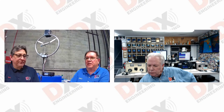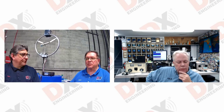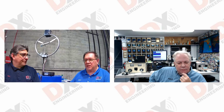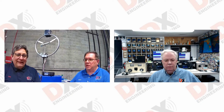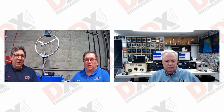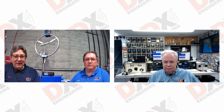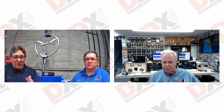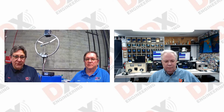We had a customer that actually put it on, I guess it's a deck of some sort, and it worked well in most directions, but sometimes he rotated it a little bit and he couldn't get it to tune. But yeah, he was happy with it. He used it as it was. I mean, that was his choice where he had to put it. There are going to be some situations that you would hope that it would work, and it may not because of the proximity. I mean, even though these loops are insensitive to surrounding metal, you can't have them closer than 6 feet to other metal.